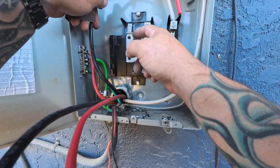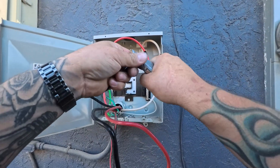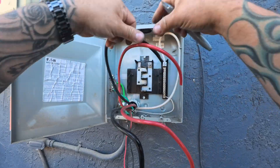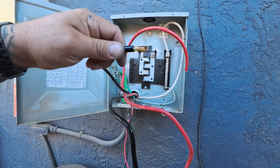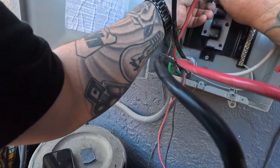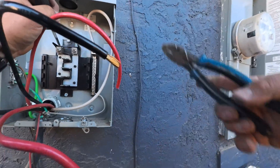There's a little bit of pitting up here on top of this bussing. I'm actually going to move the breaker to this side and I'll have to put some breaker blanks in there. Still pretty burned up — I'm going to cut some more here. This bussing needs to be bent back just a little bit.